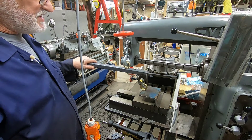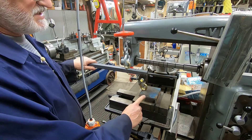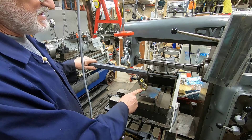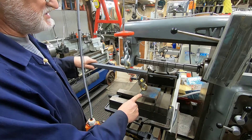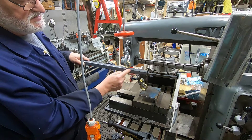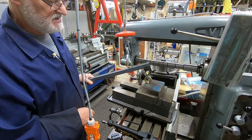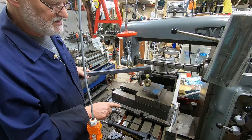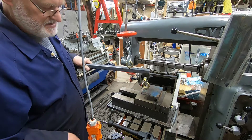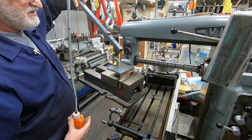I've come around to the other side of the milling machine and got it set up to lift the milling vice. That's being achieved with this bit of angle iron bracket clamped in the vice jaws, to give me a lift point which is about the center of gravity of the vice. And even with this set at the longer, further-away pivot point — so less leverage — it is actually still quite easy to lift that off, because it's so much lighter; it's probably only about 20 kilograms compared to the 50 of the rotary table. So obviously it works pretty well here as well.